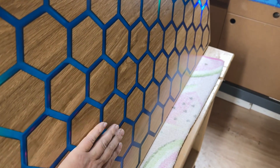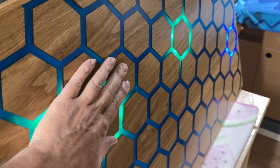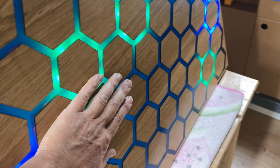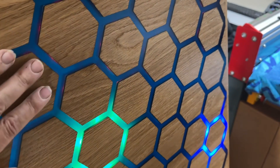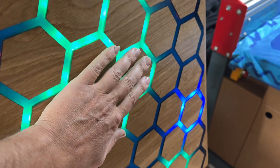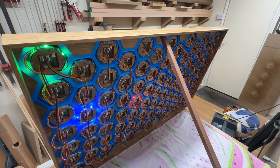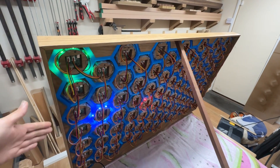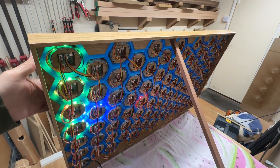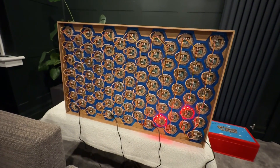This is where the pain started. You'll notice that although it works of sorts, there are quite a few false activations, and you'll also see some very dim red glows. These LED strips are RGB, which means they rotate through a whole host of colours. Seeing as the resin is blue, the red hardly shows through — that's an area I have to address later, but at the moment that's the least of my worries.